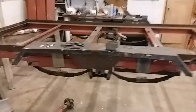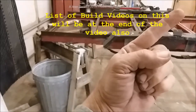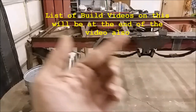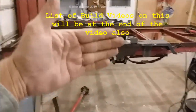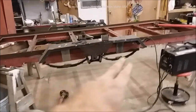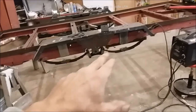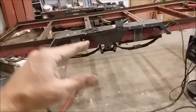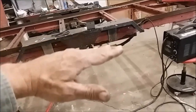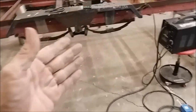People that don't understand - if you go look at the videos right up here in the corner, you're going to see how this was built. The videos are pretty in-depth where I took two separate trailers and made this double axle. It came with originally the slipper springs, so they went up and went in the pockets, but they don't ever want to track right. The axles don't want to track right, which puts a little excess tire wear.